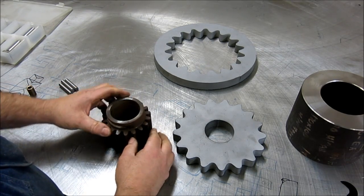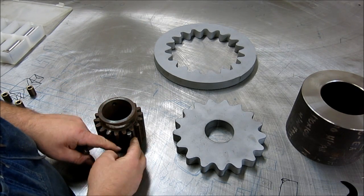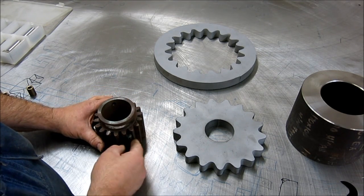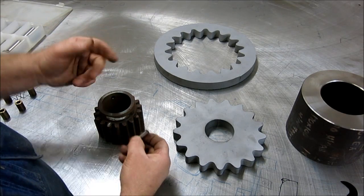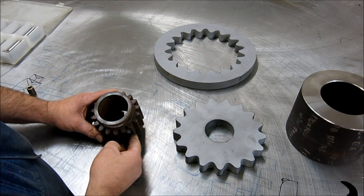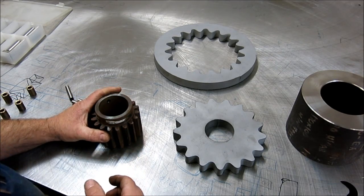The cool way to do it is you put a precision pin in. This precision pin is actually contacting those two tooth faces. So what we do is put a few pins around in there, and what that does is simulate a circle that is the average of all of those faces — we are placing a precision filler that references those important faces. You really want to bore these on the pitch line. Every gear system, when you have two gears in mesh, there's a pitch diameter. So ideally you're boring it on the pitch diameter.